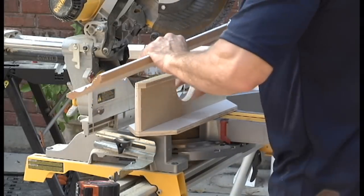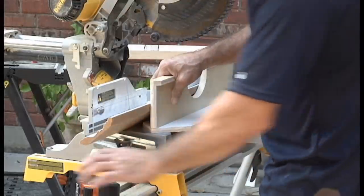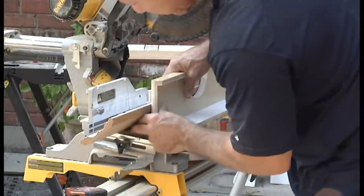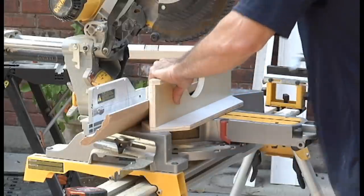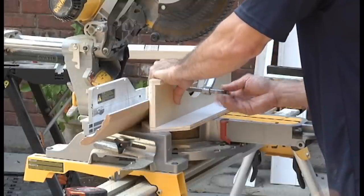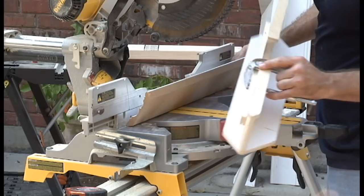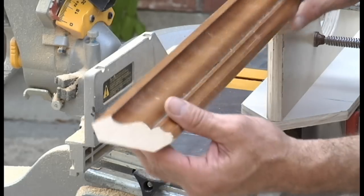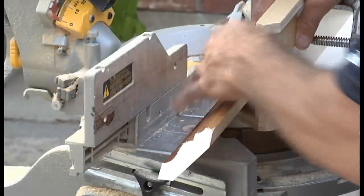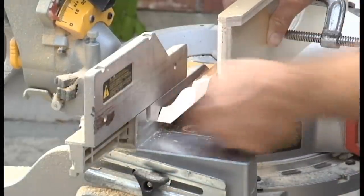It's going to work the same way. I'm going to make an inside cut with this. Set it down on the saw and make sure it's flush right here with my fence. Once it's flush, I take my bar and slide it over on top. Make sure you keep this flush against the edge. Then I can take my clamp, slide it on, and tighten it down — once it's tight, everything's locked in place. I can slide my piece back and forth and put another piece on anytime. This is two and five-eighths inch crown — real small. It's not going to touch the base right here, it'll sit on the plywood, but it's still going to work perfectly. As long as it's lined up with the fence, it's going to hold perfectly and you can make your cuts the same way.